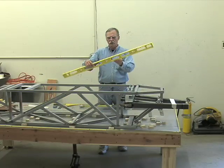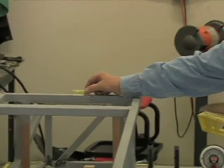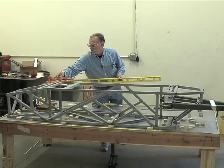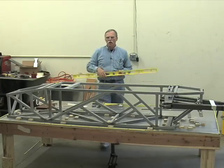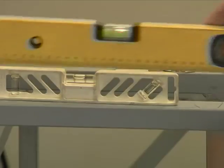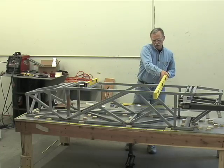Spirit levels, let's talk about them. Here's the smallest one you'll ever find, a little pocket spirit level. If you put that on something, that's real good, except it can only measure across a span of the length of the spirit level. Get it where it won't fall down from the key ring, right? That's a very, very small degree of angle there. The longer you go, the more accurate you get. See, this one won't quite reach across. It absolutely has to stick, but longer is more accurate. Longer is always more accurate, and longer still.